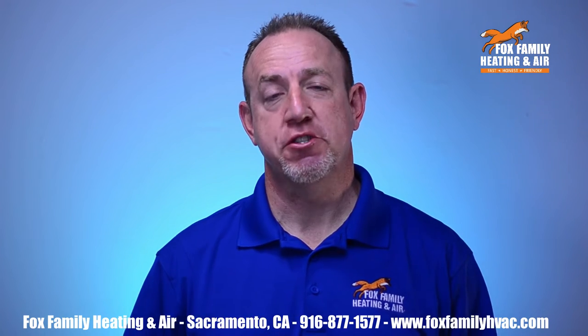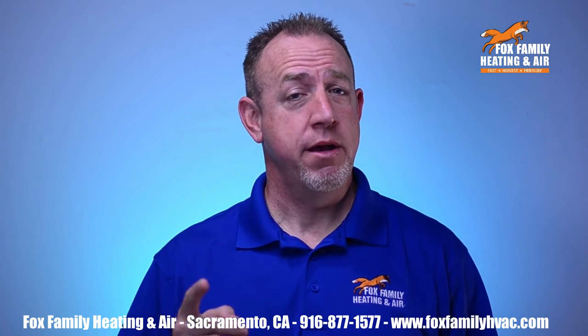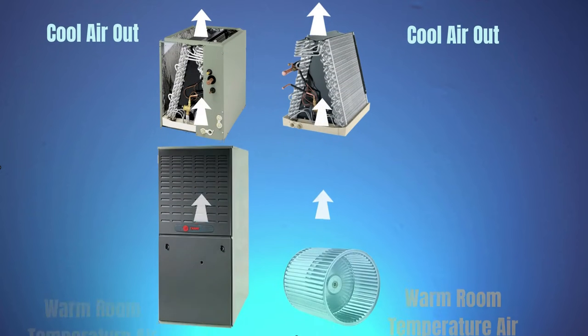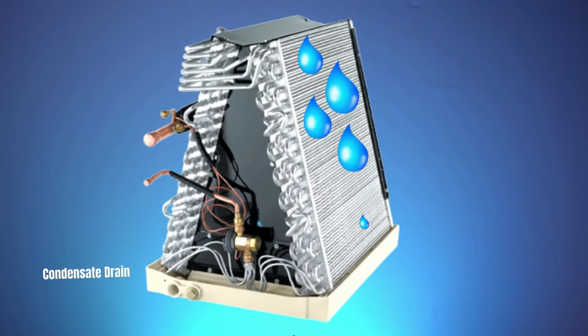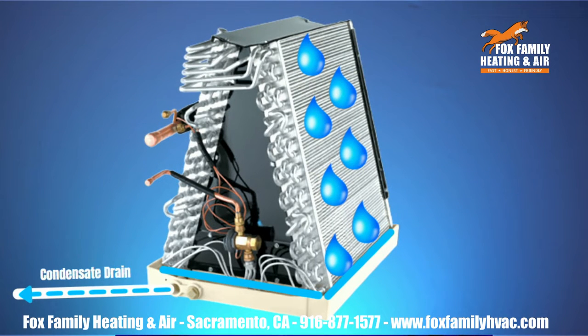A quick refresher here. The two main functions of an air conditioner are: one, remove heat, and two, remove humidity. When the AC is turned on, the moisture or humidity in your home is brought to the evaporator coil, the cold coil. The warm air from the house comes into contact with the cold evaporator coil and condenses to make water on the coil. That condensate then drains out to the side of the house and onto the ground.